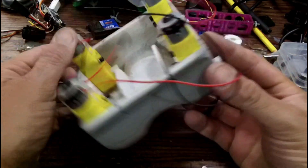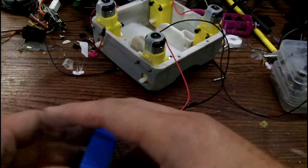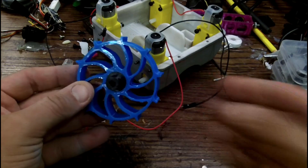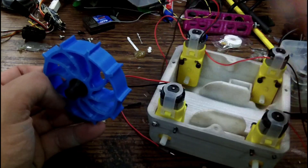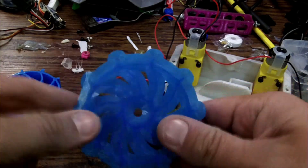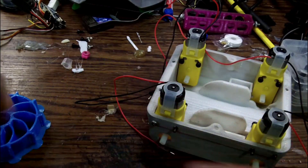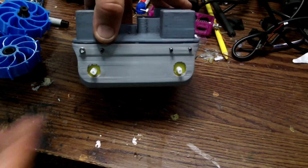All primed up, I mount the motors and make sure everything fits. I used the die grinder to offset the motor axle holes a little bit because I was off slightly — the dimensions I got were a little wrong. I'm going to use wheels from a previous robot I built just because I'm in a hurry; they're probably better than the design I made for this robot anyway. The top of the body is printed out now and gets the same primer treatment as the base.